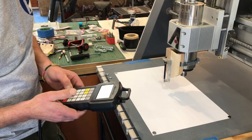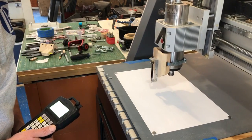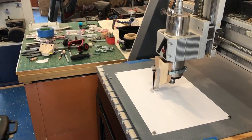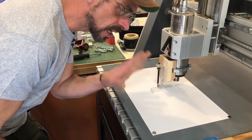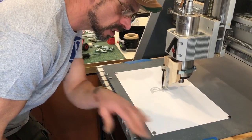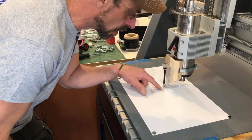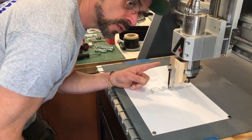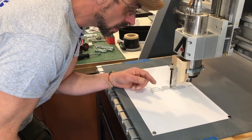Now let's just run a quick little project. I'll show you a couple seconds of it being drawn. Now we're in real time. You can see how my machine shakes a little bit when it makes those quick changes — that's why you want to attach your drawing surface to your machine. This file was actually designed for a Sharpie marker and I was solid filling it, which is why you see those lines — that's the step over. As far as speed of travel, you can set your inches-per-minute feed rate for essentially as fast as the machine can go, because you're not going to break the tip of the pen.